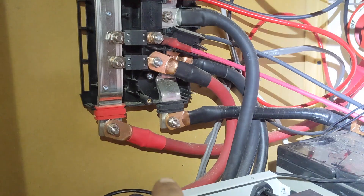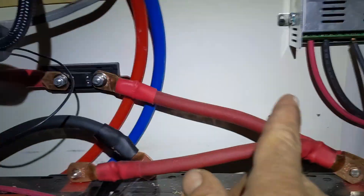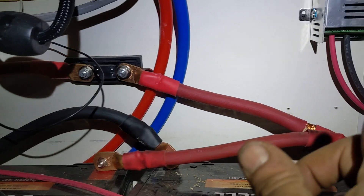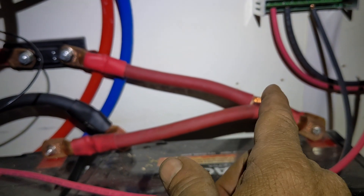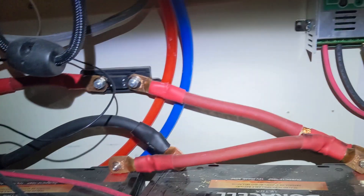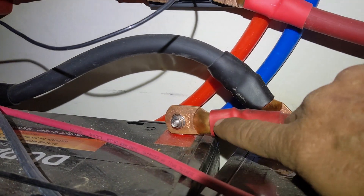We turned the inverter off and the voltage dropped back down. So I started tracing back — we checked voltage at the batteries, but after we disconnected the charge controller we were only getting millivolts up here. What that tells me is that the charge controller, and not the batteries, was what was providing the 12 volts DC on this bus. When the inverter was on it drew more than the charge controller and panels could provide, and it would shut down.